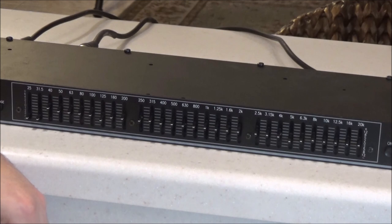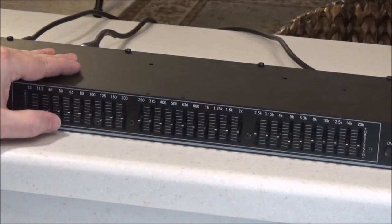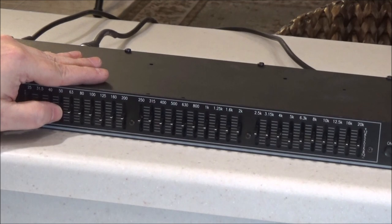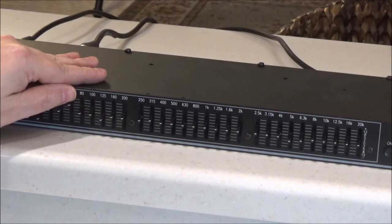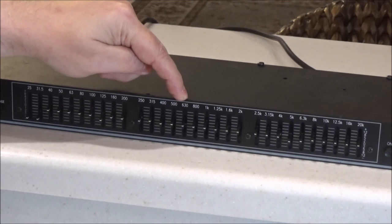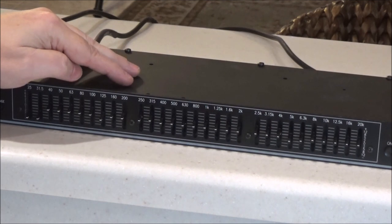Okay, so we're just going to check now and see what's actually giving us problems. So 40, nope. I'm going up with them and seeing if something takes off, meaning feedback, it takes off. That's your official lingo. 50 hertz, 63. There's some frequencies like 630 hertz that are just nasty, and you're going to want that gone a bit. You'll see when we get there.